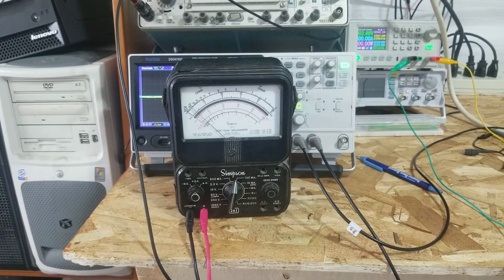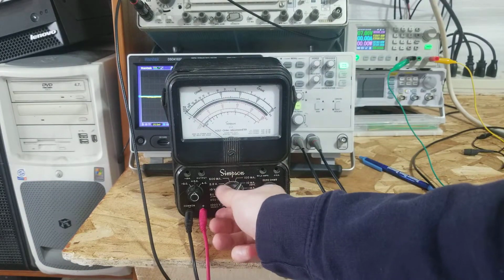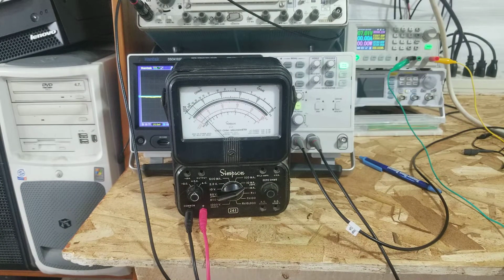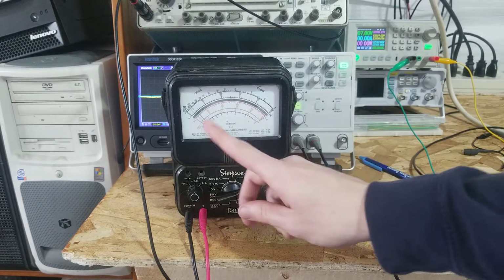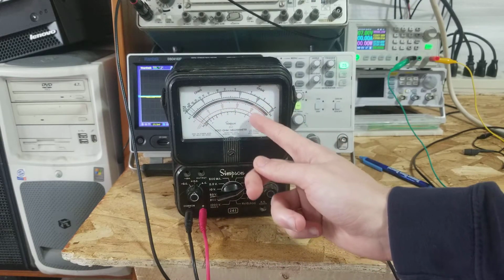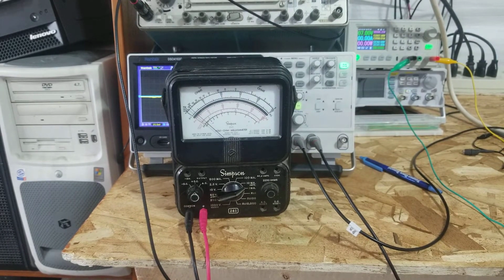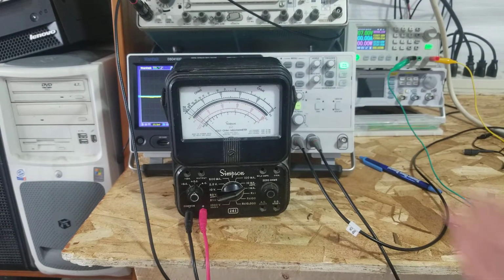So now the voltage is going up. 5 volts, 6 volts, 7 volts. Now let's see the leakage. The leakage should be less than 300 microamps, I already did the math on this one. And as you can see, it was way over before. I didn't show the process of reforming it, but it was all the way over there. I let it reform, and now I have less than 100. Less than 50, actually. So this thing came back to life in like half an hour. It's been sitting, and I just tried it again, and it immediately goes down to excellently acceptable ranges.